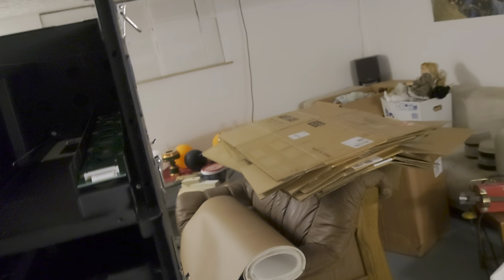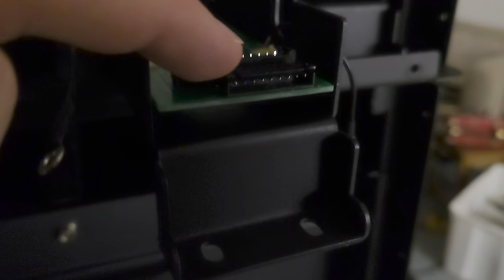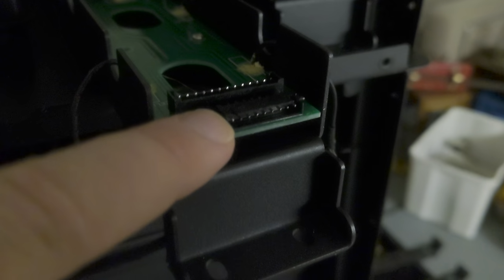Maybe one thing to mention, what I realized when the package came to me, and this was one of the advantages of the newer cases. That's why I did not choose the V2, because I have three V2s already over there. But the V3 and the V4 have additional terminals, let me explain. Usually this bigger connector here is for connecting to the BMS, and this is for the first 8 cells and this is for the second 8 cells. And you realize that there are two additional connectors here. So they have a smaller connector also here and here.